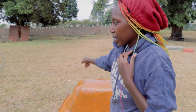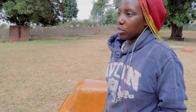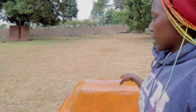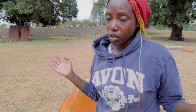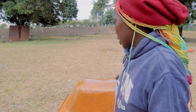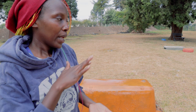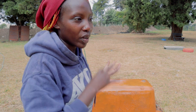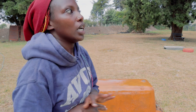Now that explains why I had four liters of the other paint. There are two ways to achieve a matte effect. One is: let's wait for this to dry, and then see if I can just go on top of this with my silk paint, because the color is the same — it's just the finish is different. Option two would be to continue painting with gloss, then paint over the gloss with a matte varnish — which is way too much work, because gloss paint takes way longer to dry.